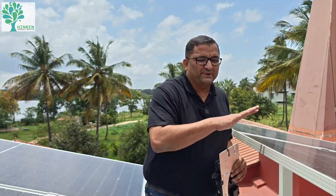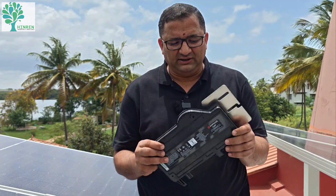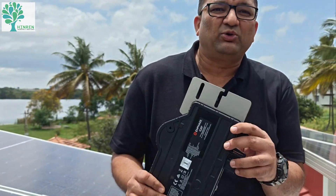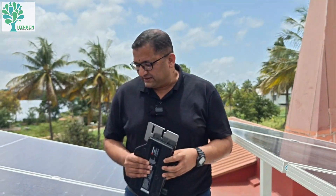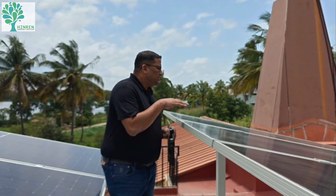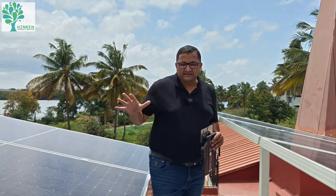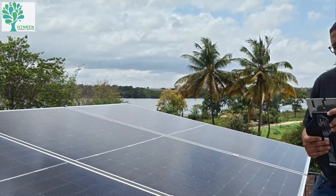We have 4 plus 4, eight panels, connected to micro-inverters. What I'm showing you is a micro-inverter — currently the latest series of IQ8P micro-inverters available in India. I've spoken about the advantages of micro-inverters in a separate video, link in the description. Essentially, these are 8 panels with 8 inverters — 8 independent discrete systems, each panel independent of the others.